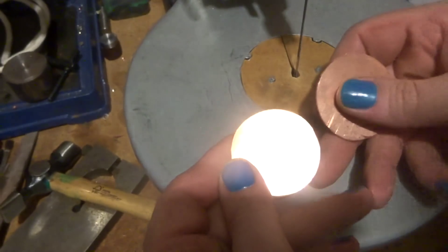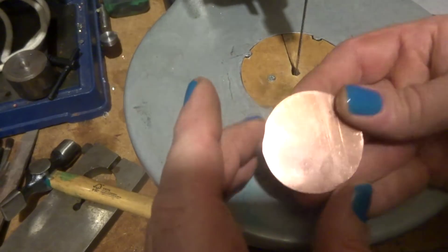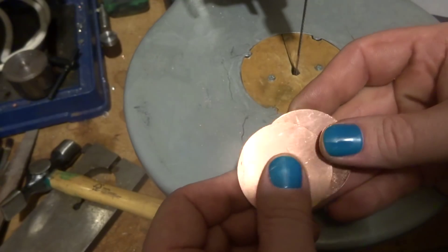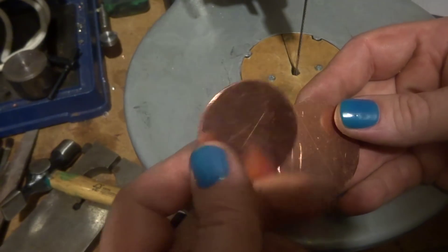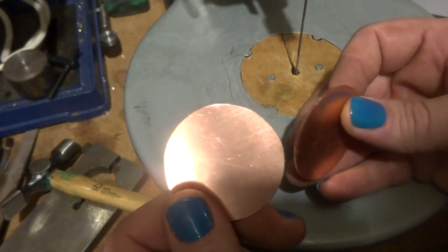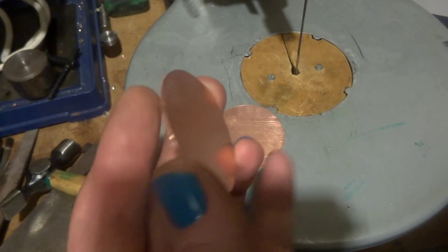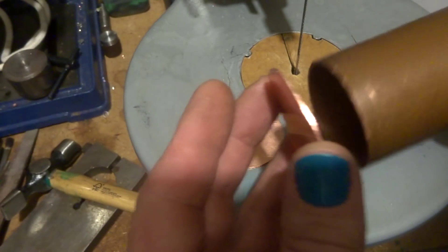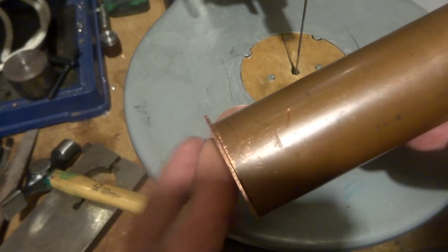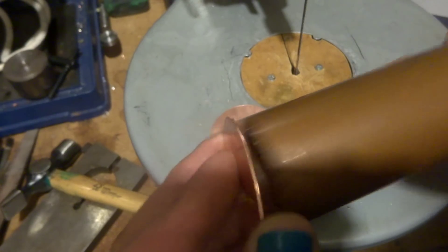So about another five minutes work and I've got two discs. You'll notice I haven't center-punched the center to mark them, because I reckon that would probably provide a weak point in the boiler — it's not good practice. So there are two discs. They've got to be flanged over a former and fitted inside the boiler on each end and then silver soldered.